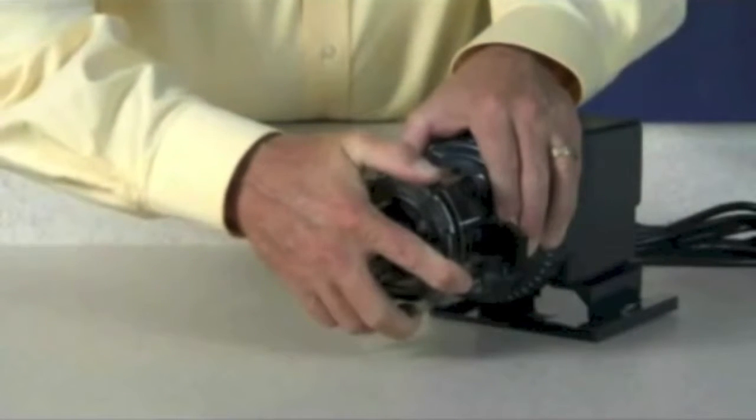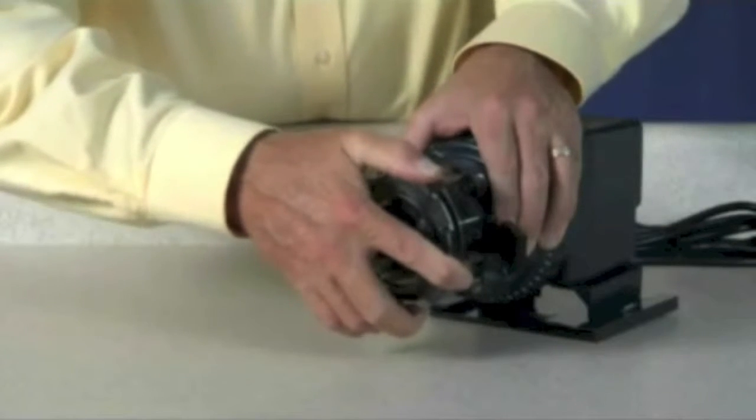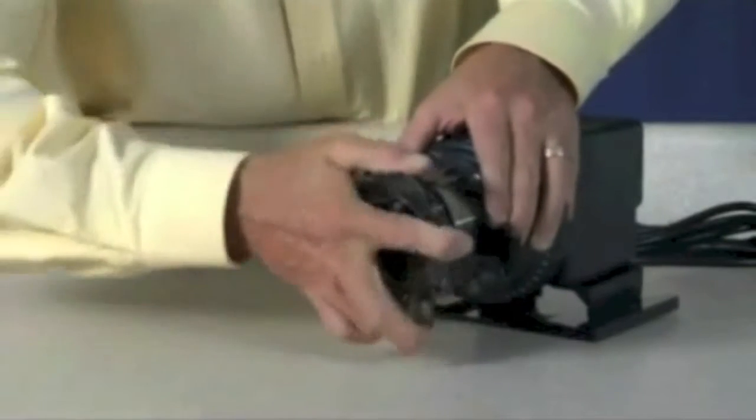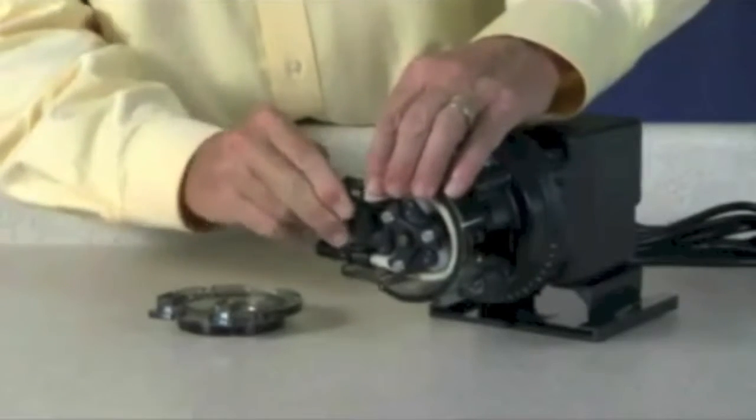Hold the feed rate control securely. Use the tube housing cover as a wrench and quickly snap. Rotate the cover counterclockwise to collapse the roller assembly. The tube will no longer be pressed against the tube housing wall. Remove and discard the pump tube.